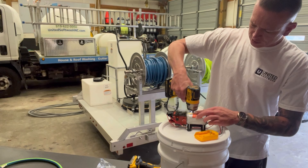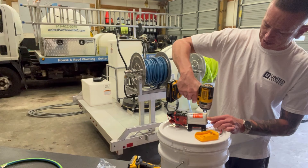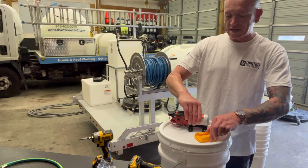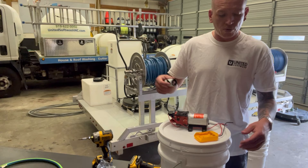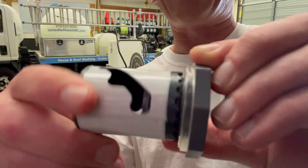Right now all I'm doing is mounting down my pump and battery adapter, and then we're going to drill a hole for the bulkhead. I'm keeping this one very simple — I don't even have the right size nuts and bolts and I don't feel like going to Home Depot, so I just use some screws. Be careful if you've never drilled a hole for a bulkhead — it's real easy to pick the wrong size. Take your bulkhead and your drill bit, and it should just barely slide right over your bulkhead threads. That way you know you have the perfect size hole to cut.